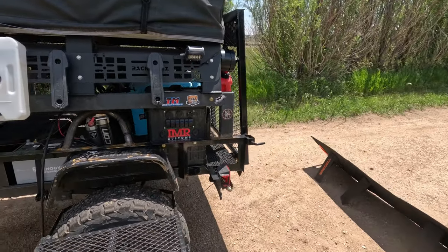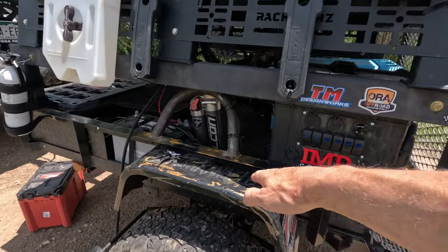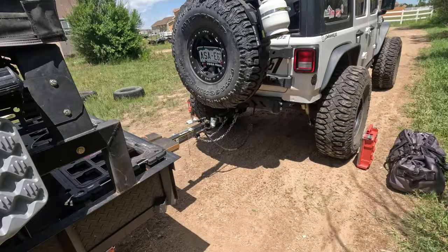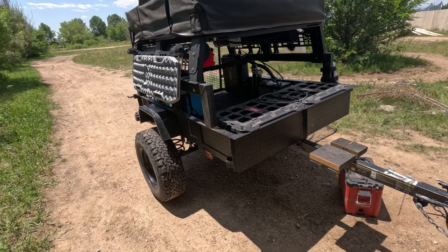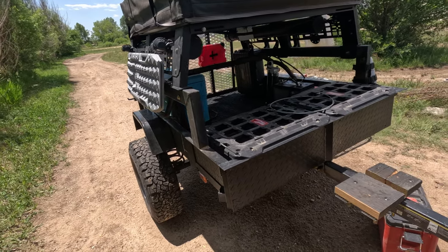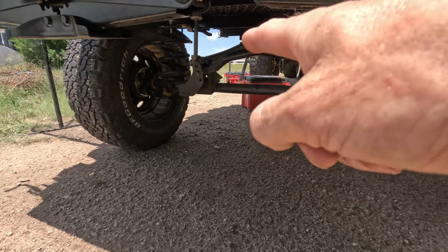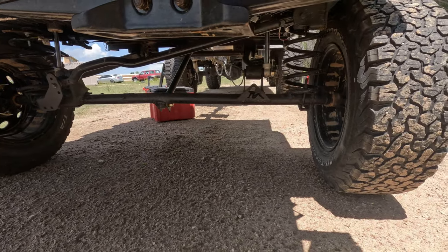This thing is so rigid now. It used to flex side to side when I'd walk around inside it — it doesn't anymore. This angle doesn't flex when you shake it. It's intact, super stable side to side. I've had a lot of people flame me online saying it's just a flimsy crappy lawnmower trailer — it was. It's just a little bit better now. It's not an off-road trailer you buy from a company, but hey, this thing works. It's the first one I ever did, I enjoy building it, and I'm probably going to build a couple more. On the back here you can see how I made the track bar bracket — that's actually a TJ track bar bracket, it's adjustable. The upper one I made myself, welded it up, and nothing's moved.